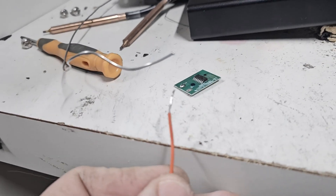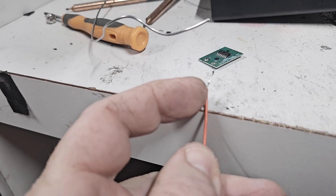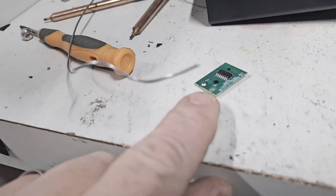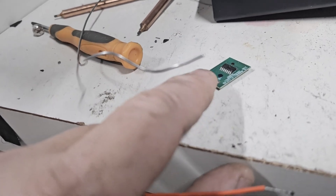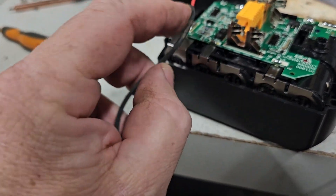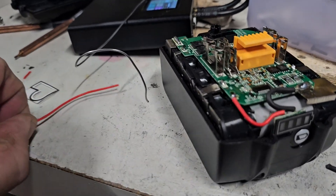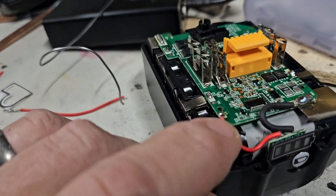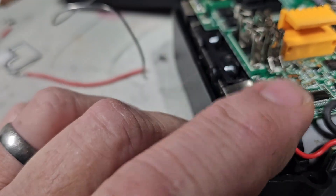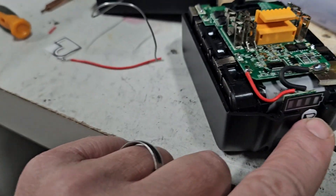Before inserting the wires, make sure that you tin your wires. Don't tin all the way down because you want a little bit of flex so that it doesn't break apart. These are lead soldered so you'll need to tin them beforehand, otherwise you won't get anything through them. Your black wire will just go to there — to this spot here at the front. The L plus is the same as the B positive and it just cuts across here and then cuts over to there, so it works fine off that.